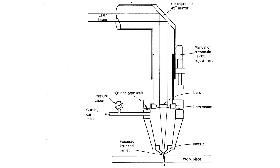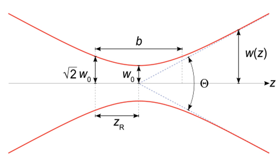If you look carefully at this picture, you will see that the point where the laser beam focuses is actually halfway across the workpiece — halfway down from the top and halfway up from the bottom. That's the ideal situation for setting the focus point. In reality, the beam doesn't focus down to an absolutely zero point. There is a theoretical point right at the middle, but in reality the laser beam curves and there is a section — length B — which is the usable length of focus, where it's approximately parallel, probably around 30 to 50 microns. It's quite important to get the focus point set to the center of the material when cutting through it. If you're engraving on the surface, you'll need the focus point set much more towards the surface rather than into the center.